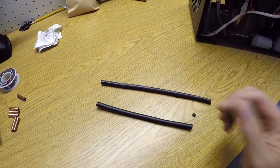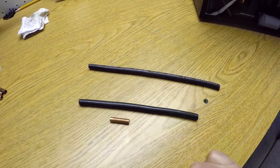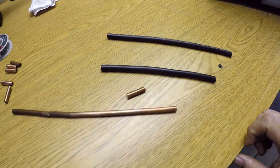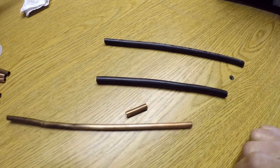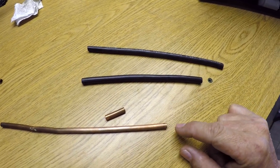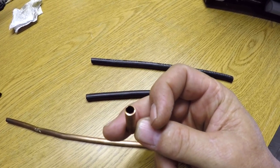I have a couple pieces of wire here that I've got cut to a specific length for the size cables that I need, and I'm using copper. This happens to be quarter inch outer diameter copper and I'm thinking it came off of a refrigerator water line or something like that. It's just some old copper I found laying around. You just need to find out whatever size cable you're using — this is 6 gauge — and find the correct size copper tubing. You can buy this in various different sizes so the inner diameter fits your cable wires right inside.